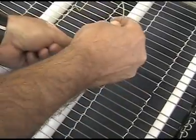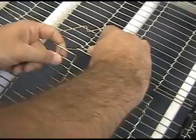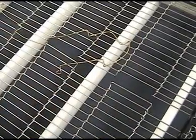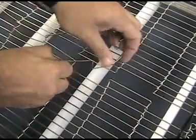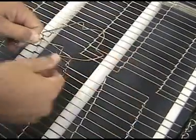Finally, bend the splice strand back towards the center and pull it around the Z-bend next to the center space. Pull it through until it locks and straighten it again. Repeat this movement until you go all the way across the strand to the end loop. It really is a lot like weaving.